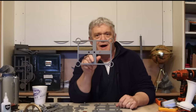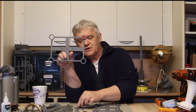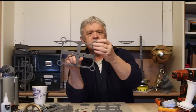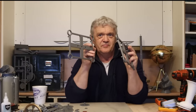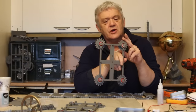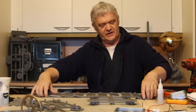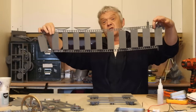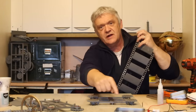Of course we need a structure. All I've actually done is printed a square, and at the corners I've put little recesses to take some skater bearings — because I love skater bearings. One goes in each corner, and then we can put on these drive cogs which just go into the bearing like that. There's a little clip at the back that we glue on, and we put those on all four corners on both structures. They've got these little clips just glued on the back so that they're free to spin — one for the top and one for the bottom. Now we've put all the links together: there it is with our flaps between. We've got a top and bottom chain; all these links are five apart, except for this one which is six, because of the unevenness — it needs an extra link to make sure it fits.